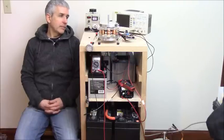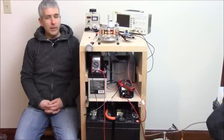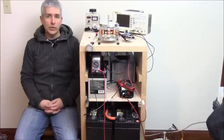But anyway, with the on time being very short, we have the more desirable effect where we have more pulses and less energy wasted than in a constant current closed loop situation. So we want the rising and falling to be as sharp as possible, not necessarily as frequent as possible, because the battery continues to charge at rest periods.